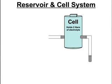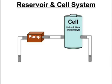The next thing that I'm going to have is a pump, which I just received, and we'll take a look at that after we do this little neat diagram thing. It pumps at about 1.8 gallons per minute. It's 12 volts DC, got it off of eBay, and it seems like it'll work out pretty good.